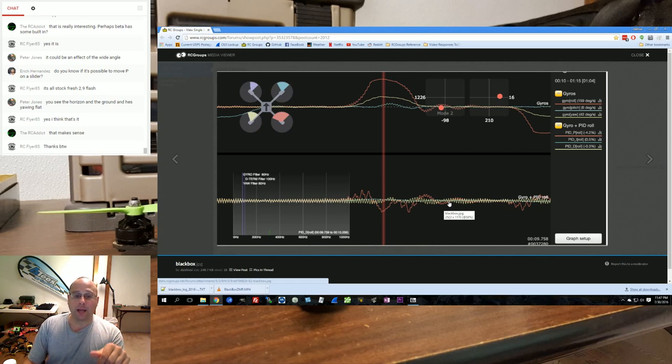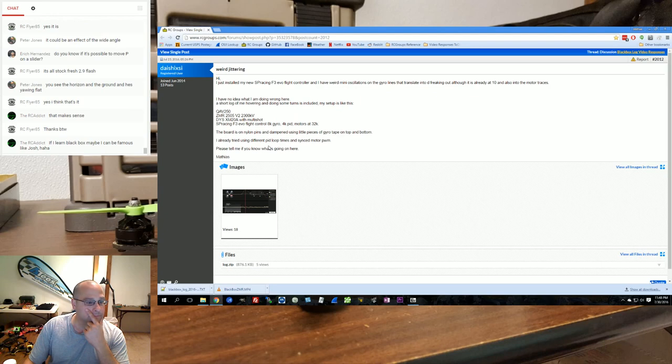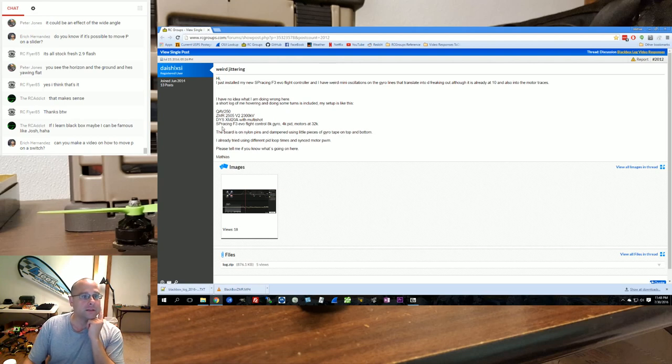But if you're sampling at a high rate, like 1 kilohertz or 2 kilohertz or higher, then I still don't think you should worry about it. It usually happens at low throttle and it's very low magnitude, and I think it's just to be ignored. I don't think there's anything you can really do about it. It's some kind of resonance in the motors or the frame that is imposing itself on the gyro, and as soon as you throttle up, it goes away. So I don't really think you should worry about that at all. I don't see any indication here of what your sampling rate is, but if you're sampling at less than, let's say, 2 kilohertz, then it's probably just aliasing and I wouldn't worry about it.